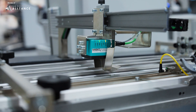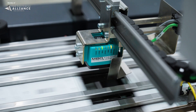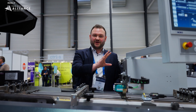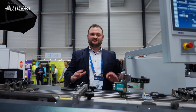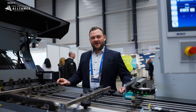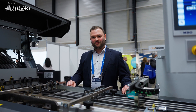Our new camera system allows the operator to check if the barcode is well printed or not. The specialty of this camera system is that it's fully integrated in our HMI, so we don't have a second screen — it's all in one. This gate is connected to our double sheet control, meaning when a double sheet occurs we will eject it in front of the folding unit to save the rollers from damage.